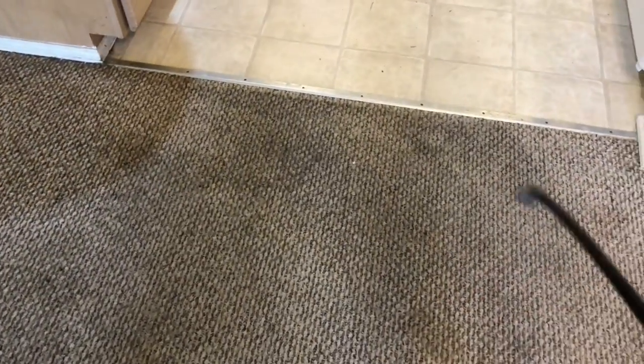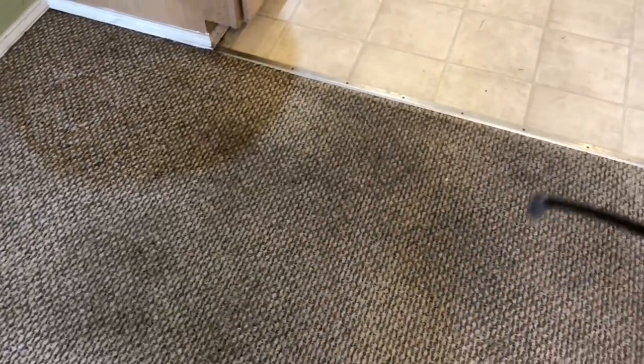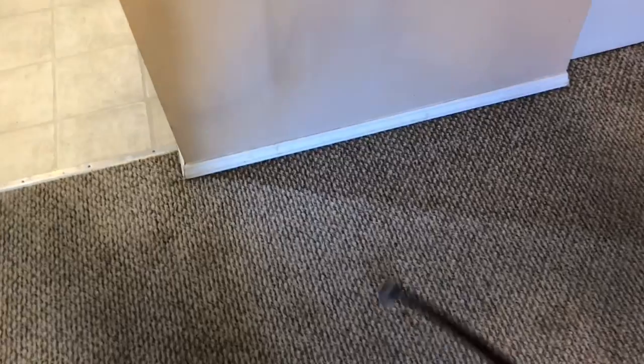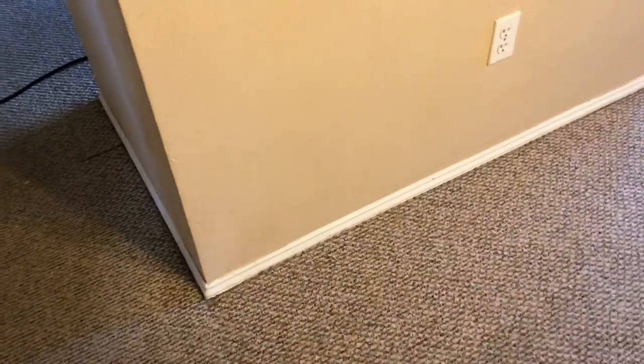Of course, it helps. I'm using a 1.5 horsepower Mytee ECO 14-inch drive with an 18-inch Zinger pad. And I brought the fiber pads in with me just in case. I thought, yeah, it's probably going to take an extra scrub, but to my surprise, the scrubbing strips on the Zinger pads were plenty. It got everything moving out in the right direction.